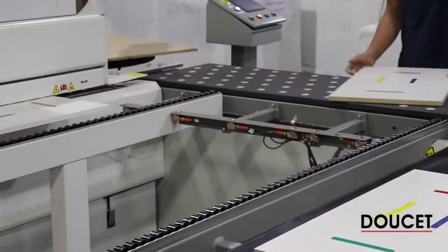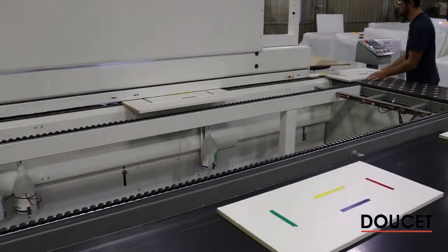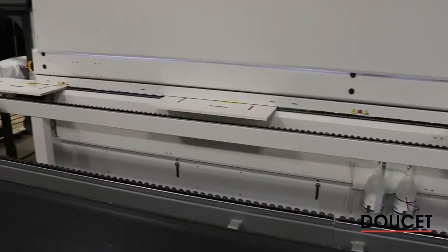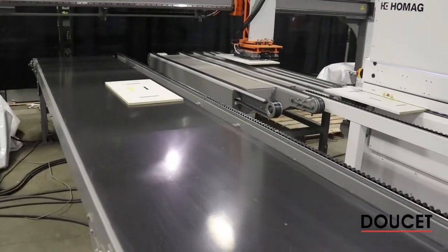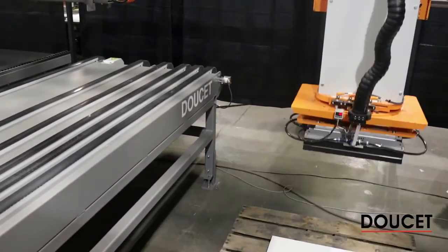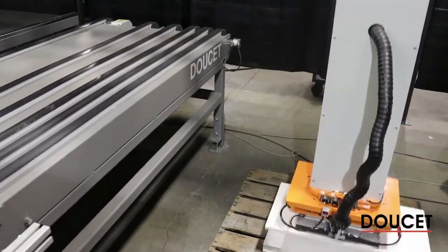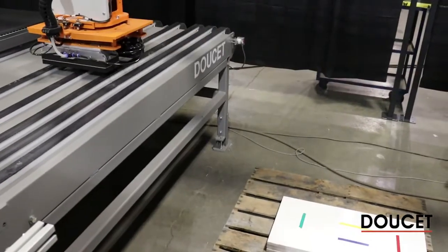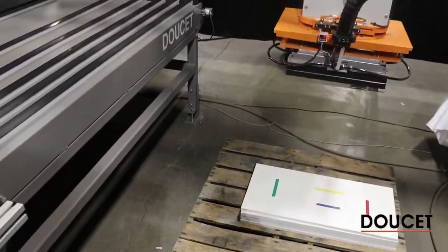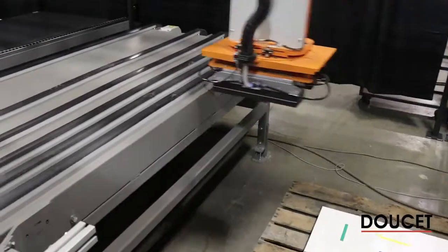Now in batch mode, the next pass is going to be the yellow line. As you can see on the return, all the pieces were rated on pass number two — the yellow line. Now that they've all come back, on this second pass the piece is going to be turned 180 degrees, versus earlier when it turned only 90 degrees. As we come out now, you can see the red indicator on the operator, meaning it was our last passage, so every piece is now going to stacking mode. In stacking mode we can do up to 7 cycles per minute, but if the pile is higher it will technically do more cycles per minute.